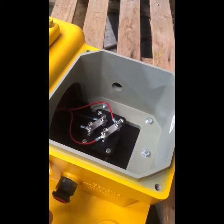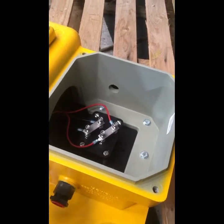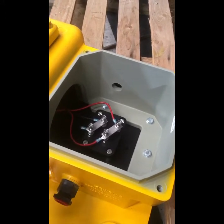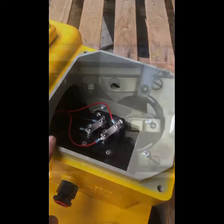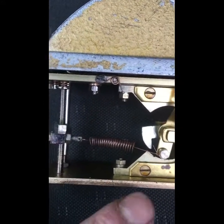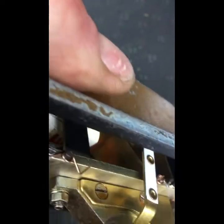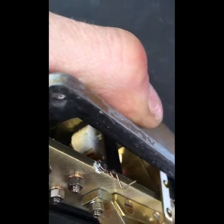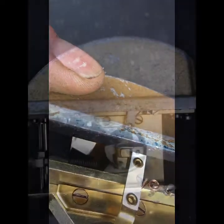So there are differences in the system. You'll find very few green ones on heritage railways because, obviously, we don't have many third rail or fourth rail systems. You will find a few AWSs on heritage railways, though. So there we have the tensioning spring, which is set at the workshops and operates onto the indicator itself. And we have the little small pole there for the E and the P — that white circle there operates off that magnet there that's brushed around.